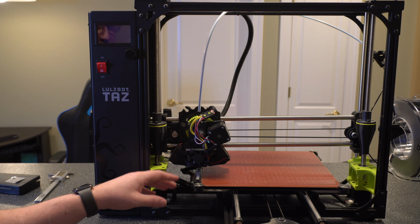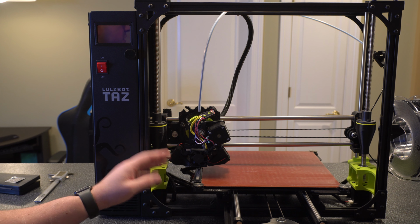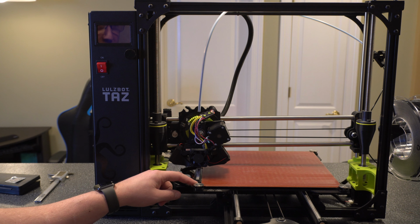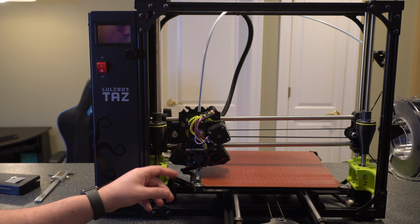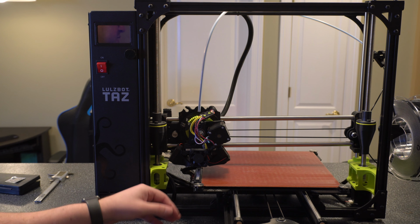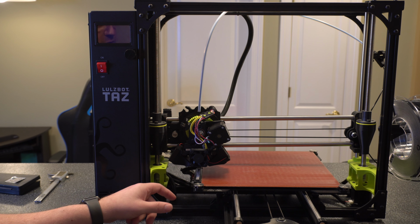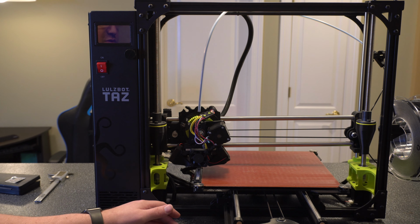That's one easy fix if you don't want to try to mess with things, but these do wear out, so that's only going to work for so long. The second one is you can go ahead and take these 2 screws out, pop this up, and then reverse the scratch pad. That's basically going to act like a new pad. You can do that a couple times, go back and forth on each side. It will get to the point where it's completely worn out though, but you're probably talking many months of usage before you get to that point.